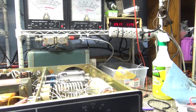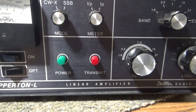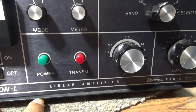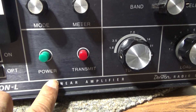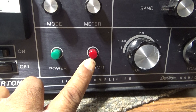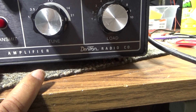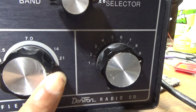It's a very basic amplifier. It has a standby/operate switch and runs on a foot switch to key it up — no RF sniffing circuit or keying circuit, which most ham amplifiers don't have anyway. The power light glows green; the transmit light goes red when you transmit. Basic tune and load controls are here to tune up the tubes.